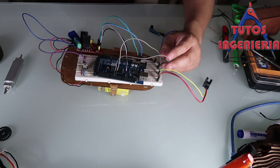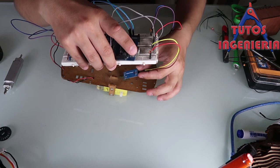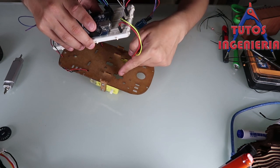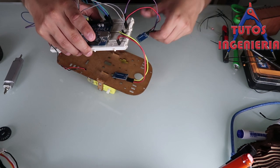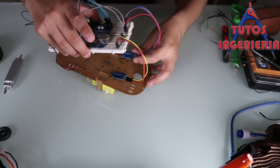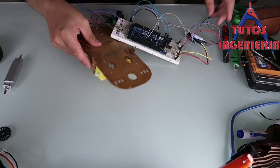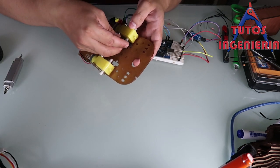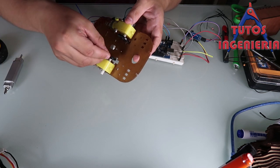The control decisions that the Arduino makes are sent as signals to our H-bridge, and the H-bridge makes our motors rotate. That rotation of our motors is then read by the encoders, which send the data back to our Arduino again — completing the control loop.